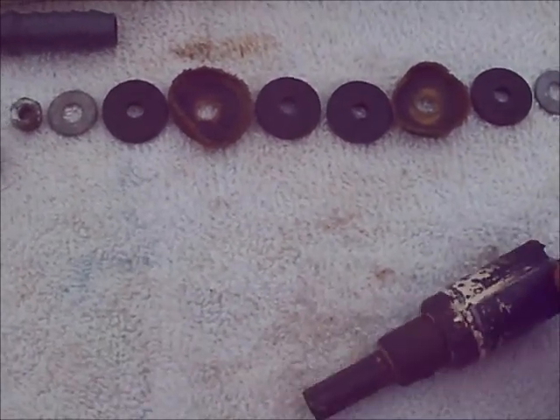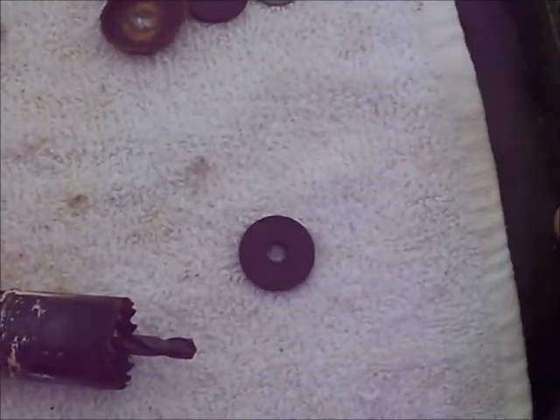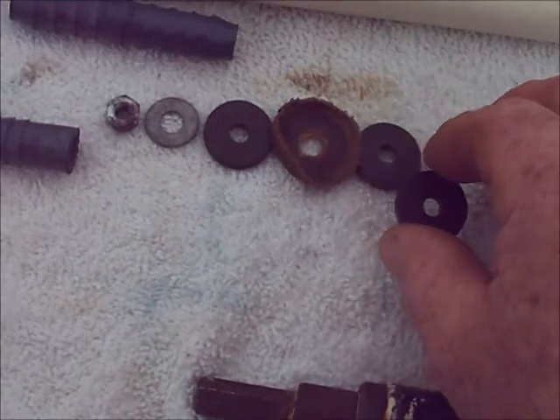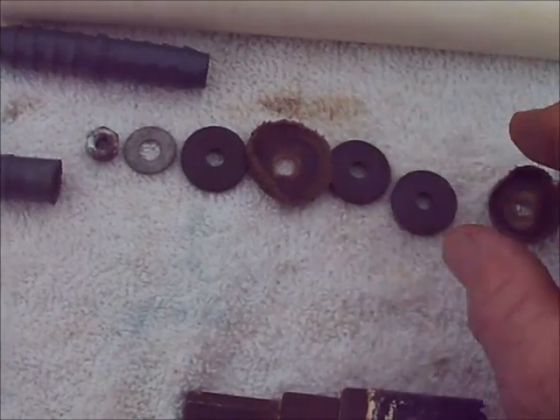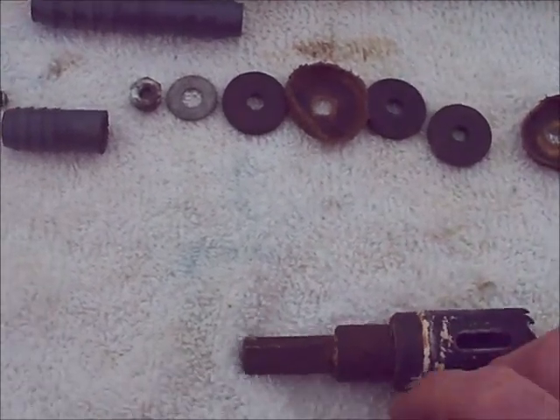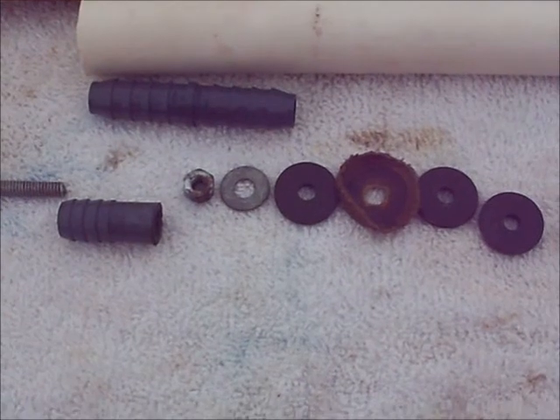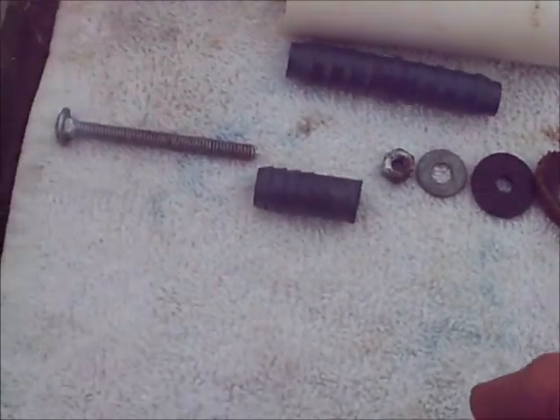This is the piston, and I cut the main washers out of a serving tray — you can see the cafeteria serving tray. I cut those washers out of that. You need four for each piston. I used an inch and an eighth hole saw, then chucked them up in a bolt backed up with two nuts, and rounded them off a little bit to relieve the sharp edges on a drill press.